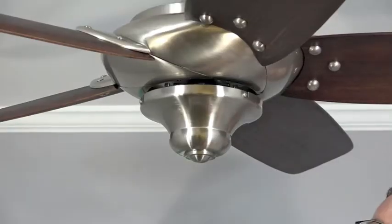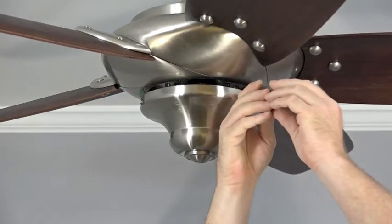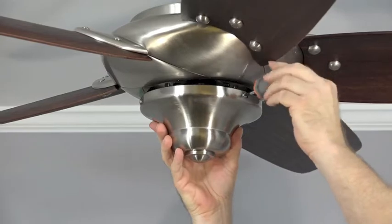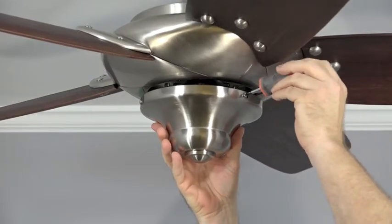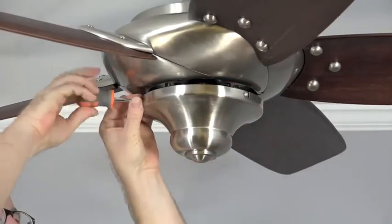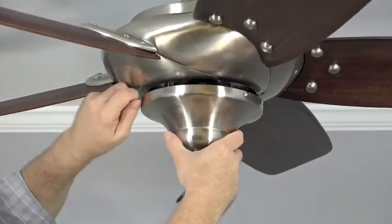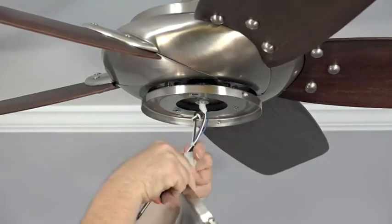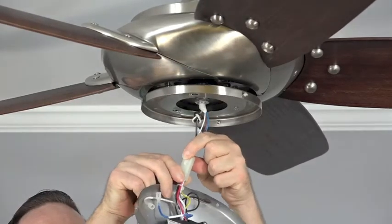The Altura ceiling fan is light kit adaptable. To add a light kit, you must remove the switch cup. Do so by loosening the 2 J-slotted screws and removing and saving the standard screw. Once the screws are removed, twist the switch cup adapter and unplug the molded adapter plugs.